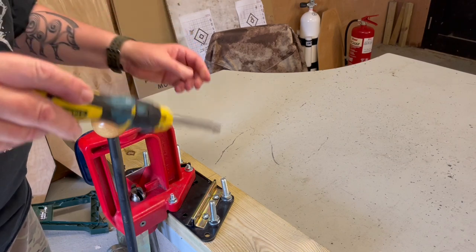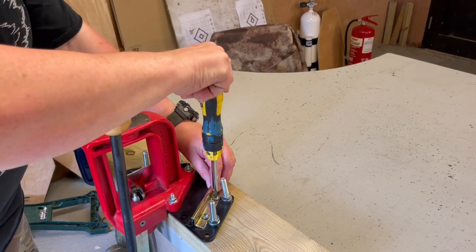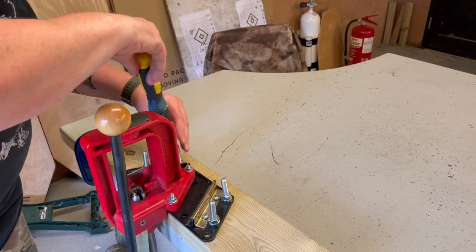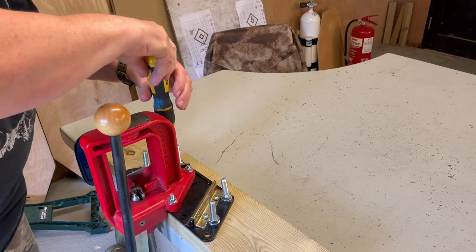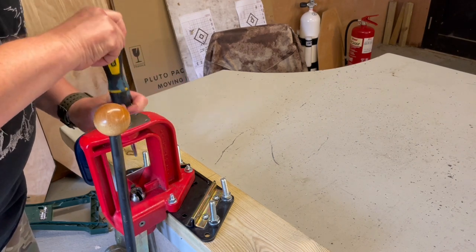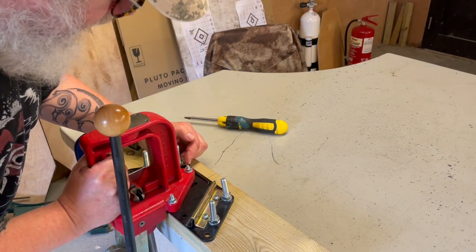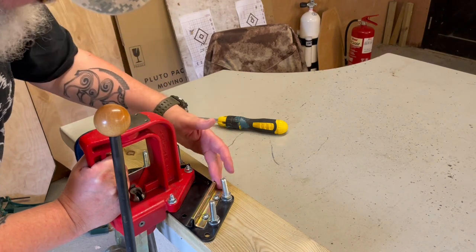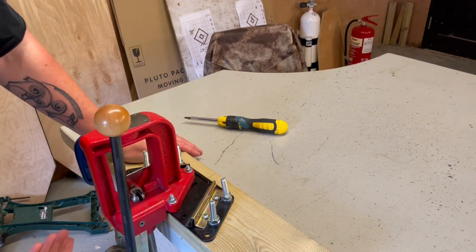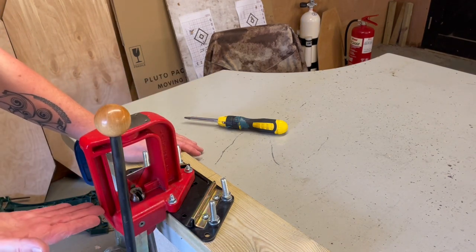These plates hold it in position. What you have to do obviously is tighten these down like so, and everything's held secure. There are raised lugs at the back of the bench block which engage with the end of these plates so you can't pull it off. Once it's bolted in and these are tight, the job's good and you've got a perfectly mounted press.